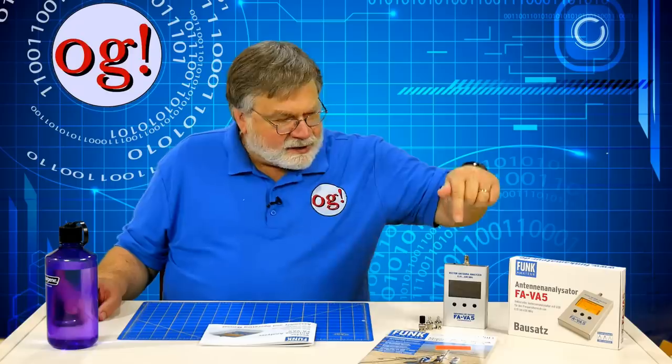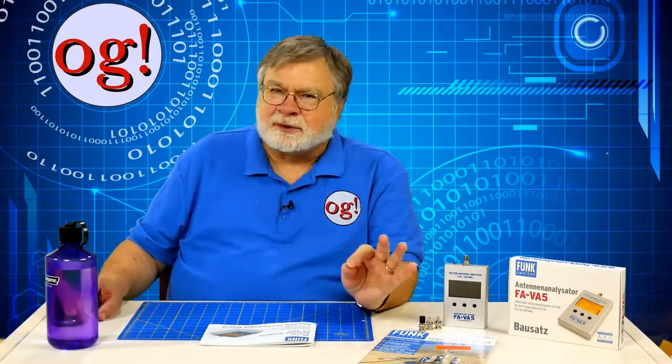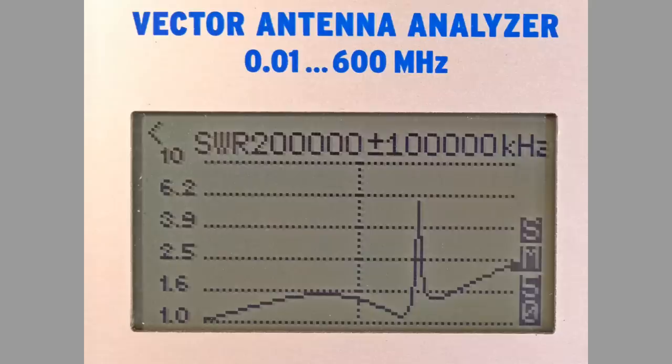This device is part of what I'm going to call the international conspiracy against PL-259s and SO-239s — the connector is a BNC. So for most testing you will need to acquire an adapter, as most amateur shacks in the United States have cables with PL-259s on each end. I used this analyzer to check my dummy load, which looks okay except for some weirdness at upper frequencies — that's one of the fun things about having a wide-ranging instrument.